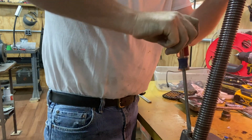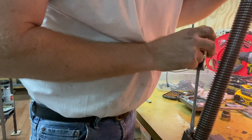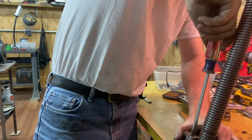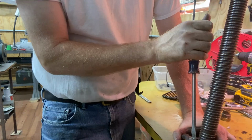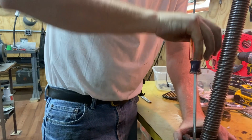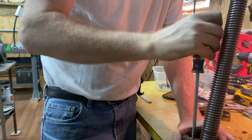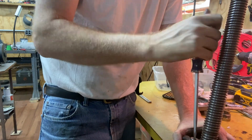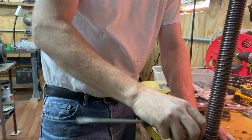All right. I think this head is somehow bent because it's rubbing up against the sidewall. It's loose there, and then it gets tight again. It gets loose. I'm gonna go use my sander and reduce the diameter on this screw head a little bit so it moves freely in here, or more freely, because I feel like I'm not gonna be able to tension the nut when I can't feel it because it's rubbing against the sidewall.